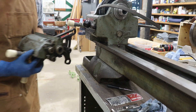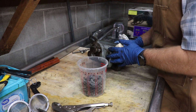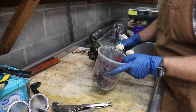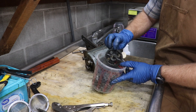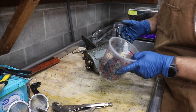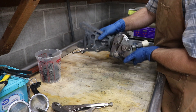Over to the cleaning bench. Here's our quick change gearbox ready for final disassembly, along with the other parts removed off the lathe. I'm going to start these in some degreaser — once degreased I'll throw them in the ultrasonic cleaner to get the rest of the gunk off. These don't get painted, so I'll just give them a light oil and they'll be ready to go back on the machine. This one though we do have some disassembly to do, so we'll get on that.